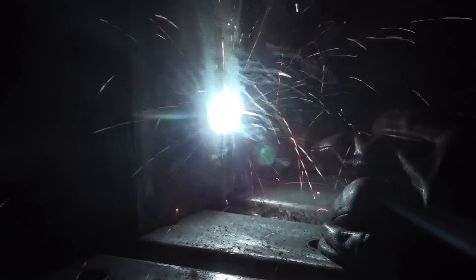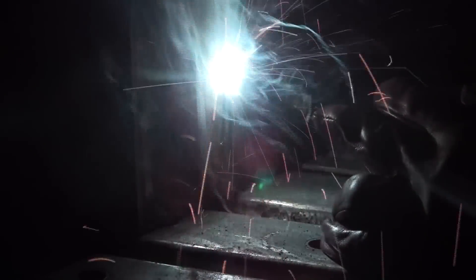Now I'm doing a vertical uphand weld. You want to keep it pointing right at almost a 90-degree angle to your weld, keeping a small arc, and then whipping it back and forth left and right — or whatever you're comfortable with — to fill in that groove. Let it fill in, and if it drips a little bit, that's not necessarily your weld — that'll be the flux — so just be patient with it.